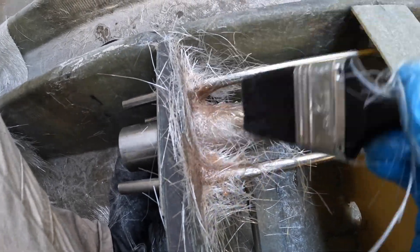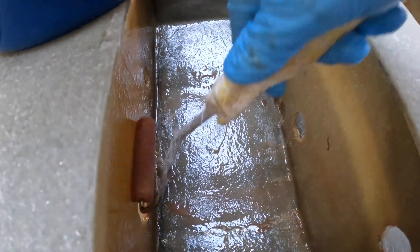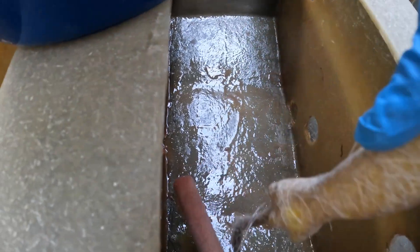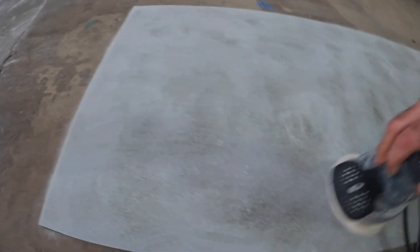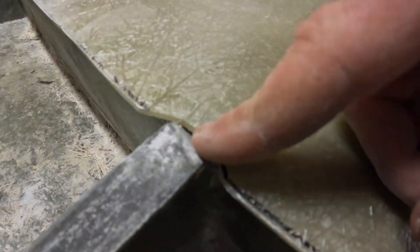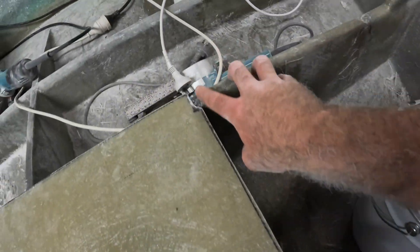This is the inside of our pipework — I'm glassing that with chop strand mat, a fair few layers. This is the waxed coat of vinyl ester resin inside the tank, which is going to help the glass cure fully and allow the tank to hold fuel. Now I'm just sanding up the lid to the tank, scuffing up that surface from the melamine side to give the glass something to bite to when we glue it down.